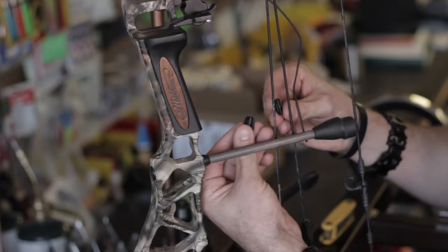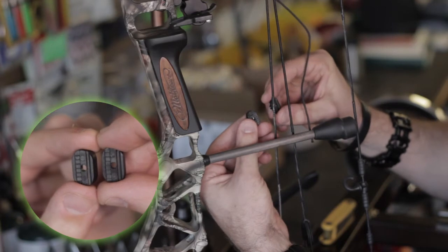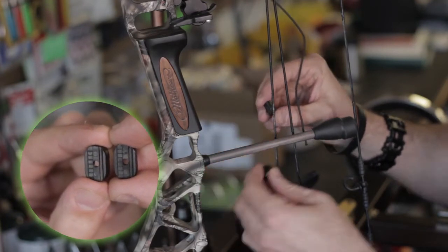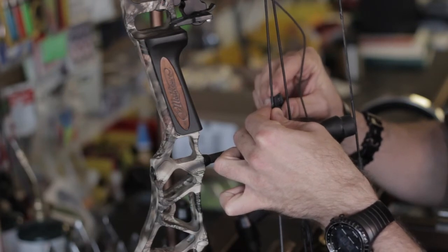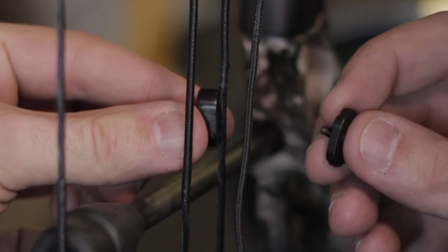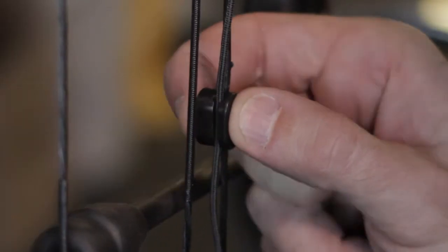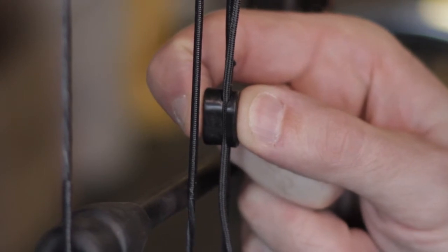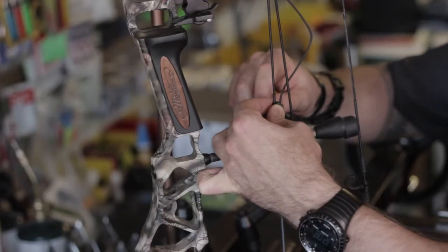the provided football clamp. And when you look at the football clamp, there's actually 2 grooves. There's a smooth groove and a rigid groove. The rigid groove goes on the downward cable side, and the smooth groove is where the timing cord will go through. So if you just take the one side, align it on the downward cable, and then put your timing cord in the other side, and then attach the 2 pieces, and then tighten the set screw.